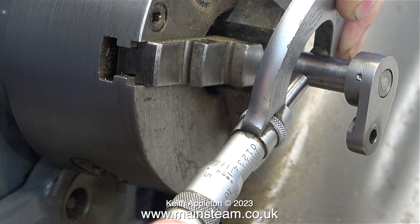The flywheel for this engine is not in good condition, because at some time in its life the hole in the centre of it has been enlarged. Obviously, because the hole in the flywheel was bigger than the crankshaft, it was a rattle fit. A while back I bought a collection of engines very similar to this — factory machine kits assembled by someone — and all of these kits had similar problems: the holes in the parts had been enlarged.